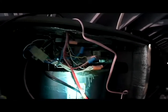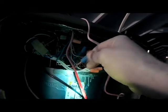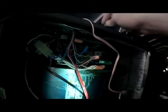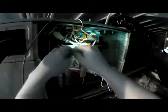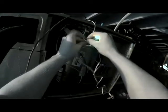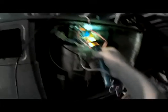Where we want to hook this up is where it comes in from the transformer to where it feeds power to our thermostat — that's going to be right here at this red connection. We want to take one of our wires from the transformer and hook it to that red wire coming in. We got that wire hooked up — this is hard to do with one hand holding the camera. Now our second wire from the float switch we want to hook back to where that power wire was plugged in.